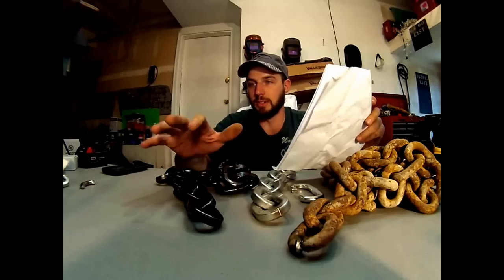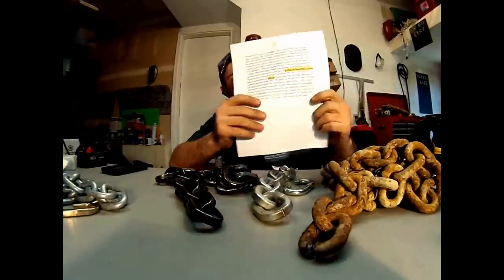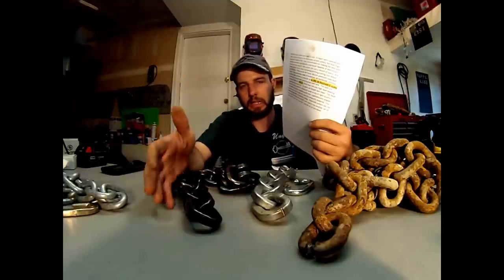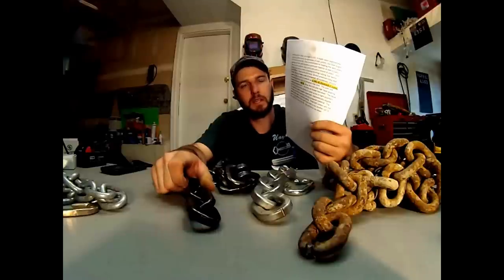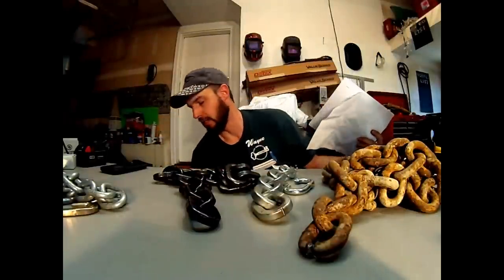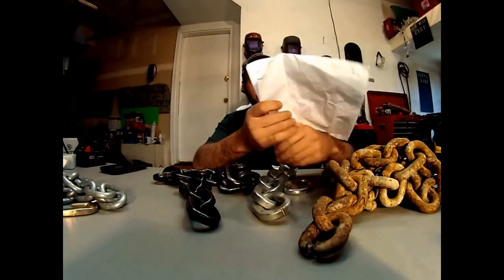Security chain versus standard big box chain or transport chain, and HK Porter bolt cutters. They are designed to cut things up to 48 on the Rockwell hardness scale. We're going to bring it back to science with the Rockwell hardness scale, because that's what's really going to matter here. If one material is harder than the other, it's going to cut it by a certain percentage. If it's not, the amount of leverage with those big giant bolt cutters is going to get it cut. The hardness on the jaws of your bolt cutters is going to be 62 — that's a super high grade tool steel, Rockwell hardness of 62. That's just a good baseline.